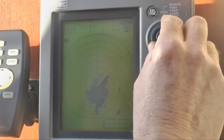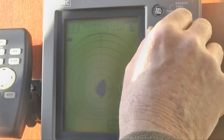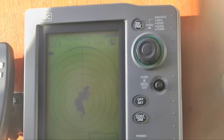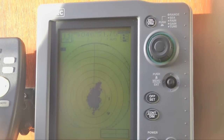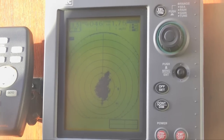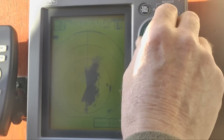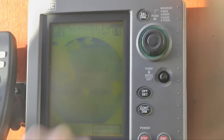Can't really test it to get to sea, can you? No. So this is on three miles now. If you look in this top box, each ring is half a mile — 0.5 of a mile. So just picking up junk around here. Yeah, there's too much clutter — you've got aerials all over the place, buildings that are a bit too close. This type of radar is quite difficult to read the picture until you go out to sea and then they work like magic, because you do get a lot of clutter and modern ones don't do that with the latest kit. But that's one mile, 0.75, half a mile, a quarter of a mile range — and you can see how it's completed.